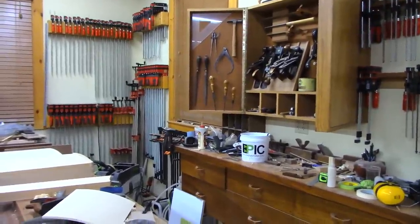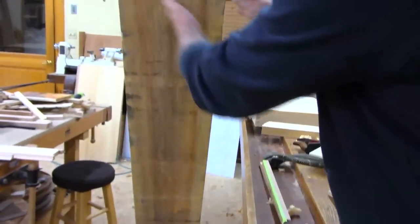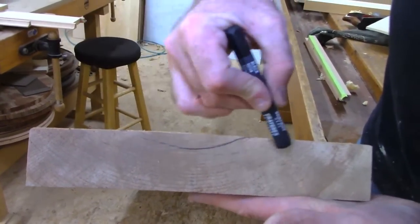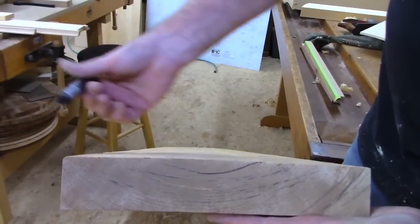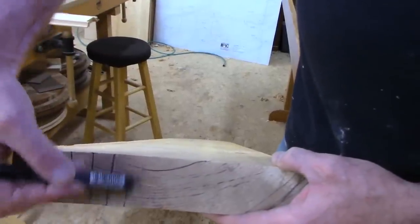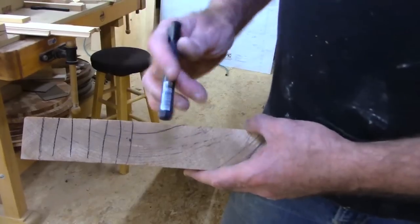Yeah. So if you got 8/4 plain sawn like this, can you see the end of that? This is just a regular, wide piece of 8/4, but typically you're going to get it plain sawn. Goose Bay has great white pine, and that's where I got this. So you can see the growth rings coming right across here. This is plain sawn. Over here, it's actually getting into rift. If you go wide enough, you end up getting into quarter. But I would just take this, and when you cut it to a shorter length, whatever your door height is, or lid, you're going to be cutting across, so you're going to end up with quarter sawn. If you buy quarter sawn and do this, you're going to end up with plain sawn on the face, which is what you don't want. Okay, so.